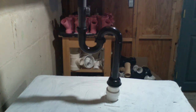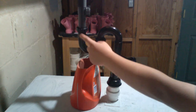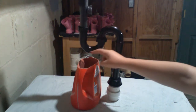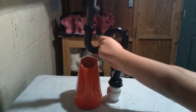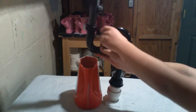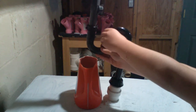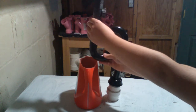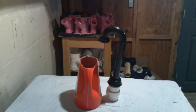First I have to loosen this nut — this nut connects the pop-up assembly to the old j-bend. That loosens. Now we have this connection here to loosen, and then this whole j-bend should drop down. This will be held in place by the sink, but in this case it's not, so the j-bend will drop down like this.